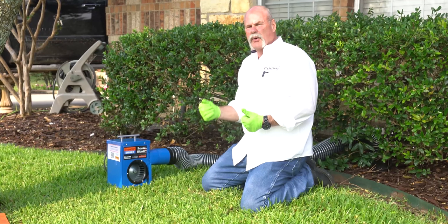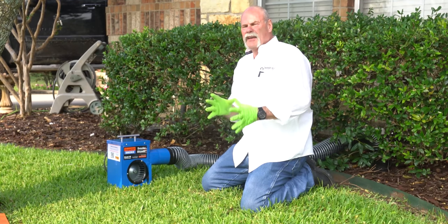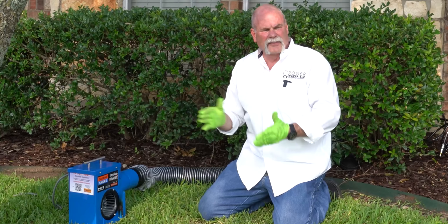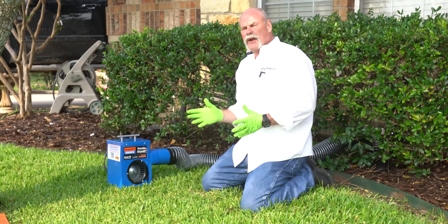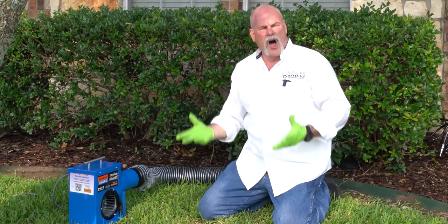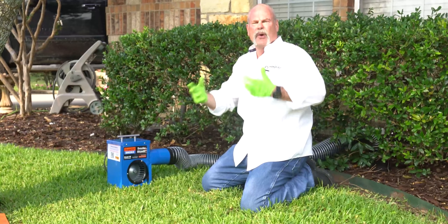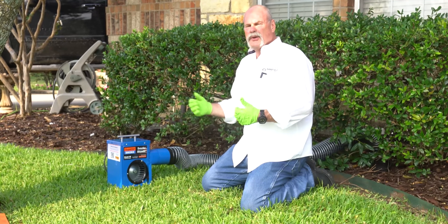Once we put the smoke in, we're going to go inside and look around wall outlets, look around any plumbing. Anywhere that smoke comes out, that lets us know there's a problem. The reason we're going to look around wall outlets is there may be a vent pipe in a wall that has a hole in it, and if smoke's coming out that outlet, I can look back at the plumbing system and see what may be causing sewer gases. I'm using the Model 5E — it's 180 cubic feet per minute. It's not going to push so much pressure in there that we blow out traps. The showers are full, the tubs are full, all the P-traps in the house are full and wet — you want to make sure you do that beforehand. You don't want to have a dry trap; you walk in and you've got a room full of smoke and don't know where it came from. Fill the traps — that way, anywhere smoke appears, you know you've got a problem.